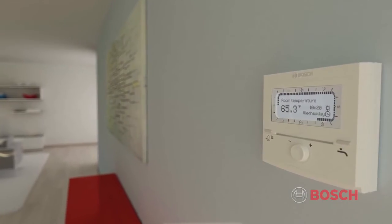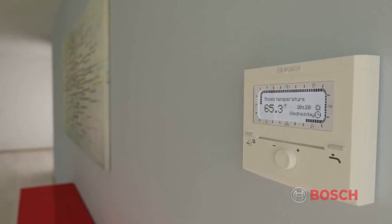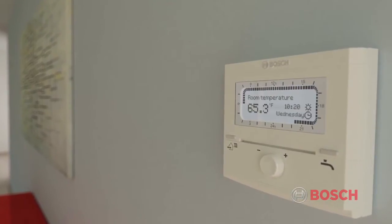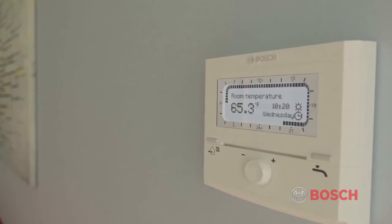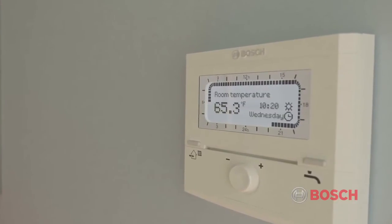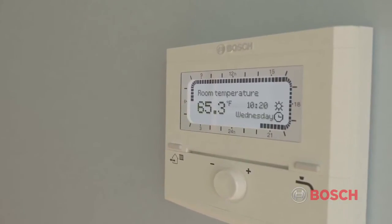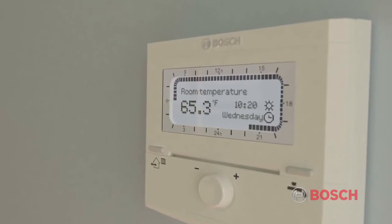The FW200 room sensor provides indoor temperature feedback to the boiler. This allows for compensation for internal heat gains such as large groups of people, cooking, solar gain, wood stoves, fireplaces, lighting, and other sources of heat. The system compensates for internal heat gains by lowering system water temperature, maximizing comfort and efficiency. This is generally used in conjunction with a constant or near constant circulation system.